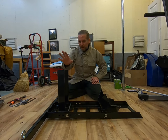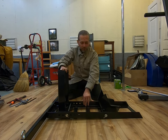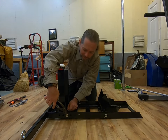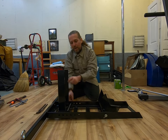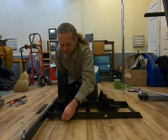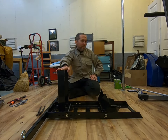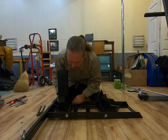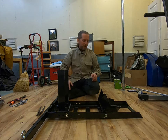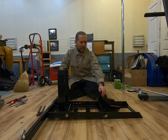Something to keep in mind — you can see there's a little bit of space here, so this cradle can move back and forth just a little bit. You can resolve that by stacking in some washers. These rods come out, held in by cotter pins and washers — there's really nothing to it. That's what makes this design so great. Put the washer on, put the pin back, and you're good to go. But this may let your wheels shift just a little bit. It looks like you've got maybe a quarter inch, maybe an eighth, when centered on either side, without stacking in some washers once you get the position right. Same with this one — it can slide around a little bit, but I might leave it since it's supposed to pivot.